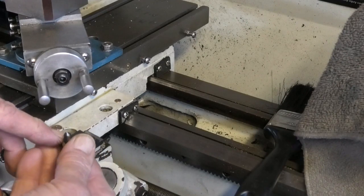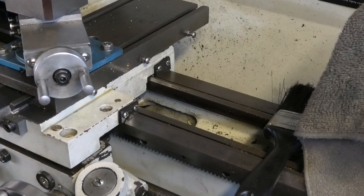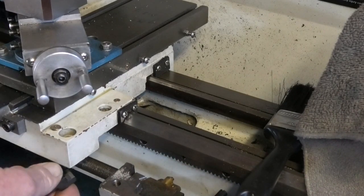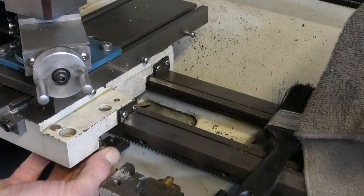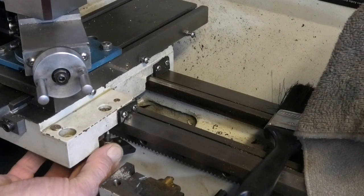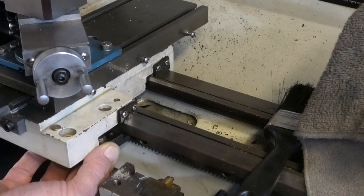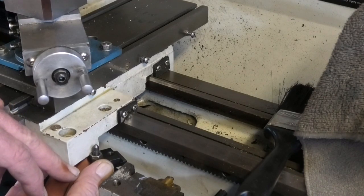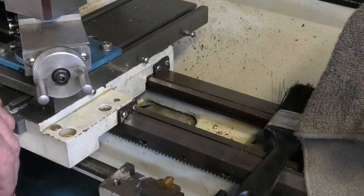It's very difficult to get this plate out, let alone do any adjustment. Luckily, only two bolts release the apron, so I moved the apron out of the way. That lets me get to the clamping position — I can come in with an Allen key and hopefully a spanner to lock it off. That's what I'm doing at the present moment: putting the carriage lock back together. I can't say I shouldn't have started, but it's been a pain.